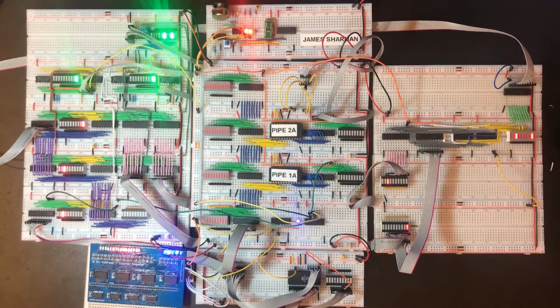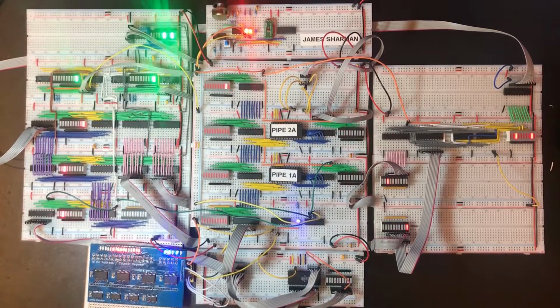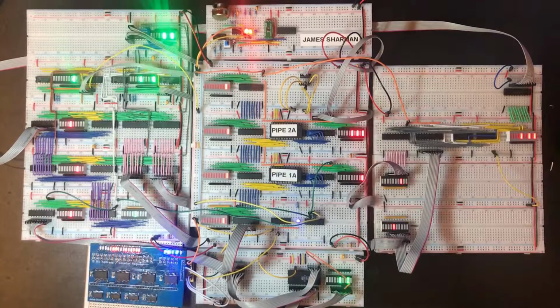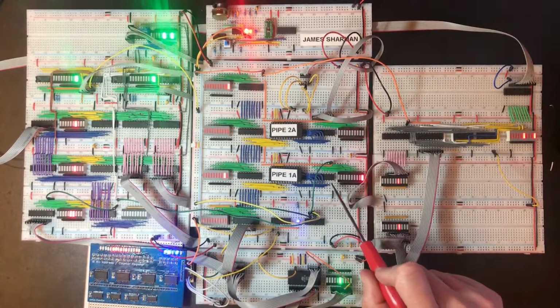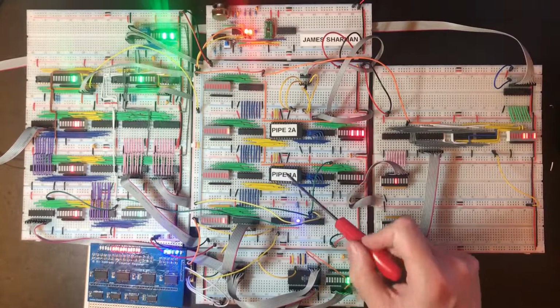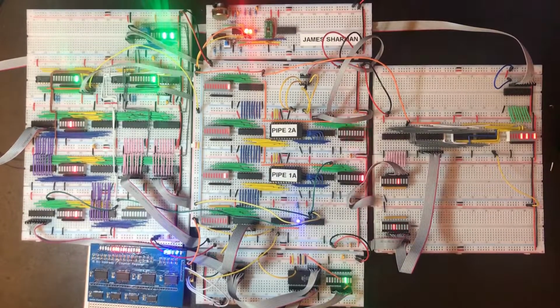I think this video is going to be long enough as it is. So in the next video, what I will be doing is connecting this up to the bus control, and then these control lines here we can connect into pipeline stage 1, and then we should be able to update the control logic in the pipelines and write a little bit of code that's actually going to add some numbers together. So that'll be pretty cool, actually. So we have some adding, if not actually completely wired into the processor yet.